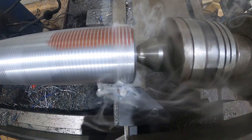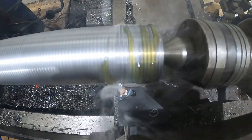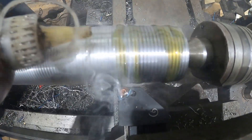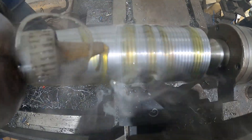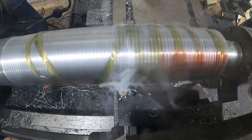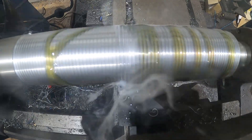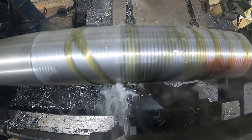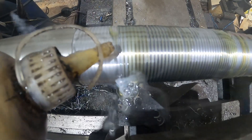Now we can take a lot deeper cut with plenty of cutting oil. We're using a 2.5mm carbide insert in the thread turning tool holder, so you can take quite a deep cut with this and it makes a really good finish. If you chip the end or it becomes damaged, you just rotate the tool and you get three goes, so it saves a lot of time and works out cheaper than grinding pieces of high speed steel.